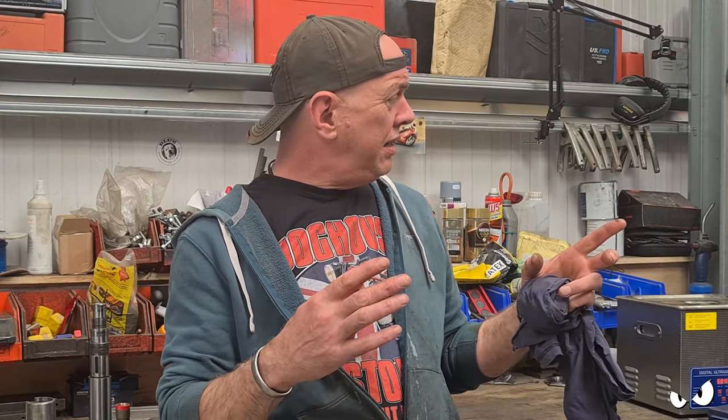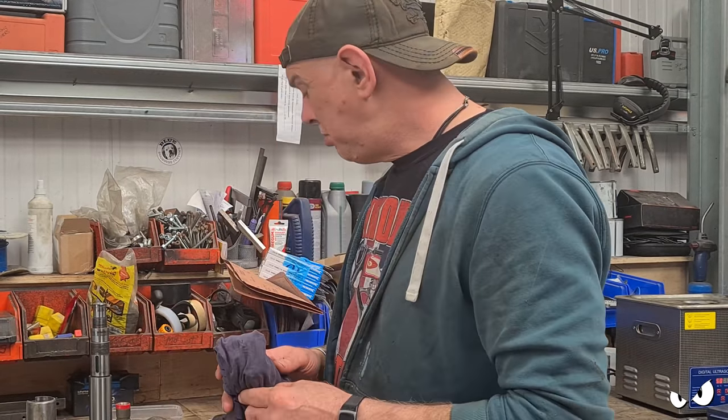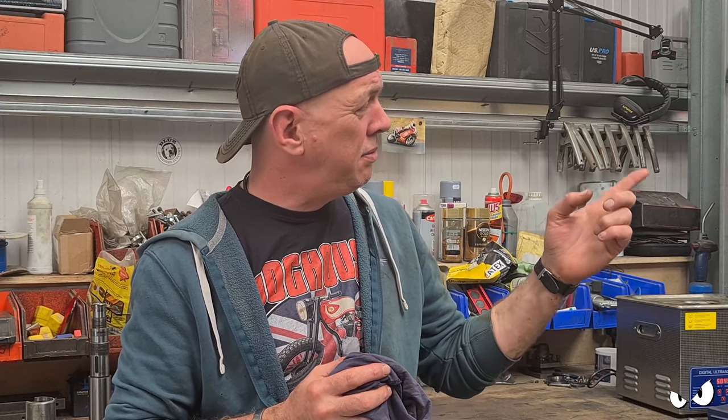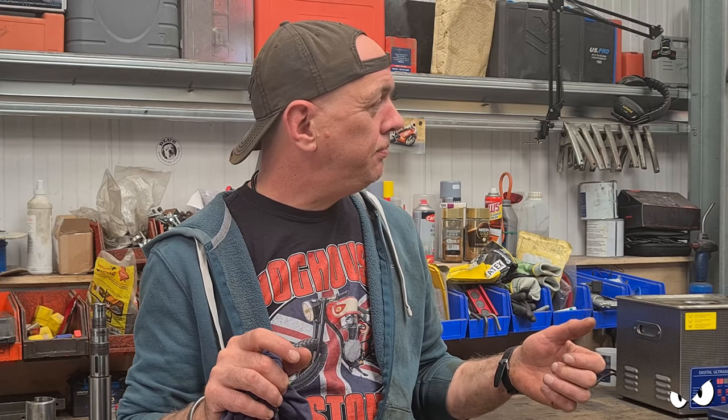Now, there are gears and a drive shaft, and then you've got the thread cutting gearbox and all that other stuff. All that is oiled separately. And I'm probably going to do this the same, actually. I know the whole head unit should not be packed with grease, because it's got a drip feed oil line in there as well, and that's for the pinion gears and so on. However, the bearings that sit top and bottom, I think they should be packed with grease, just because it is on Chuck Norris. I don't have any grease caps on the mill, on Brian.